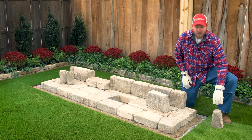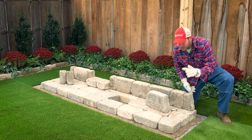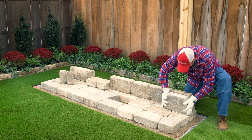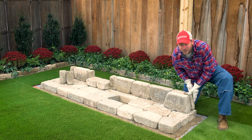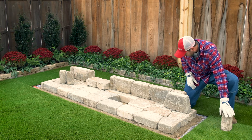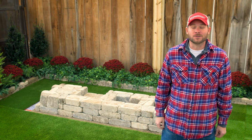Here's a little trick for setting your bunches. You're going to take your four-inch brick, put it here. Then you'll take your full-size block and line it up with it. Make sure it's nice and straight, then just pull the four-inch brick off. Once it's all glued, we're ready to move on. Believe it or not, that was the hard part. Now we're just going to continue with our build using four-inch courses.